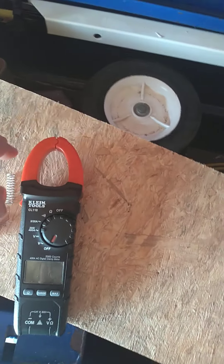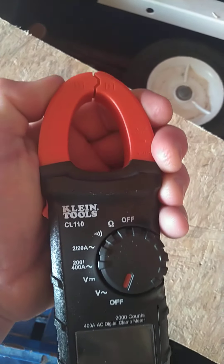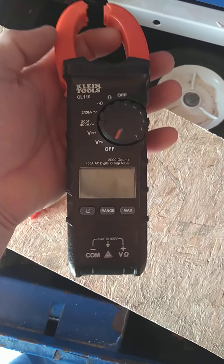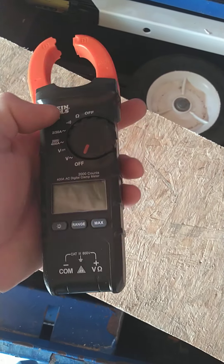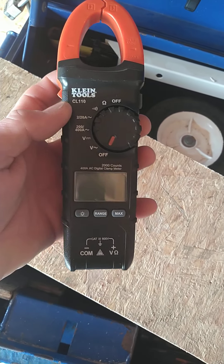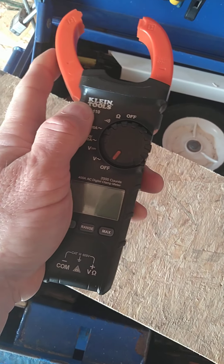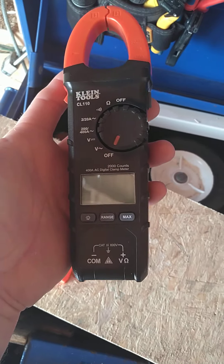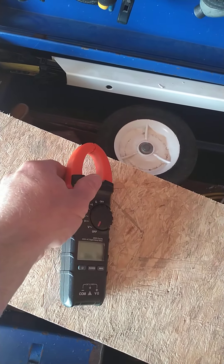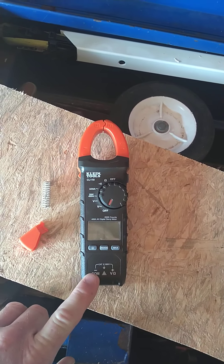For this to work, this jaw has to be in its fully closed position, such as it is now. This to me is rendered useless, because I do residential electrical work and sometimes I'll clamp this onto the main feeds coming into the house after things are turned on. If I have an issue with a main breaker, I can use this to check and see why the main breaker is tripping. And this thing didn't hold up too well.